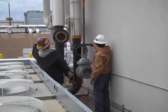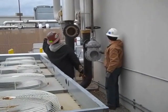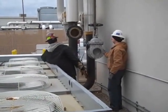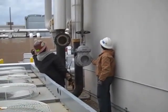What we're doing now is putting a gate valve on the flanges so we can mount that to the flanges and then mount the line stop apparatus to the valve.